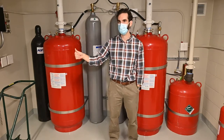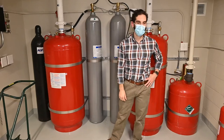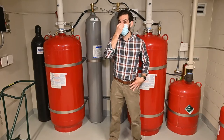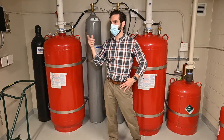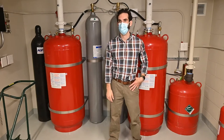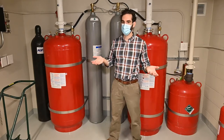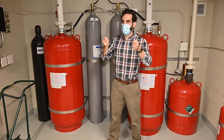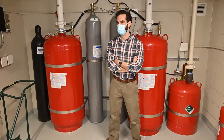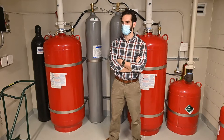What would be a scenario where you'd hold the abort button? Maybe somebody's doing testing in the space and accidentally sets off the VESDA and a smoke detector at the same time — then the pre-discharge goes off and you shut it off. More likely a technician than staff. Or if you're vacuuming without a filter and blow dust around, you could set off two smokes. So how long do you have before the system goes off? 30 seconds — you can hit that switch and hold it, and it'll send an alarm to somebody.